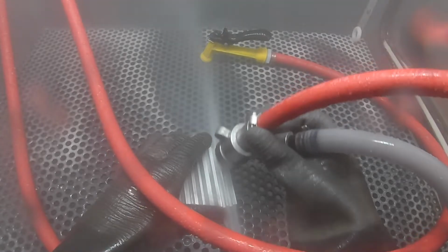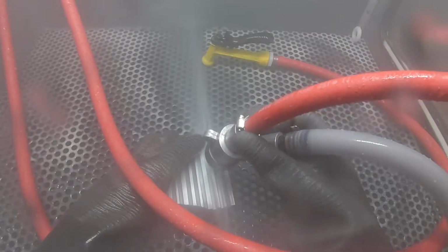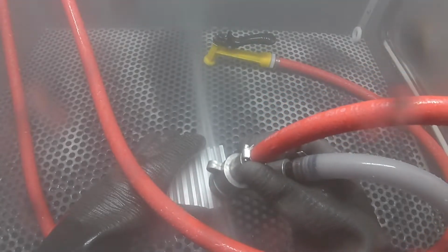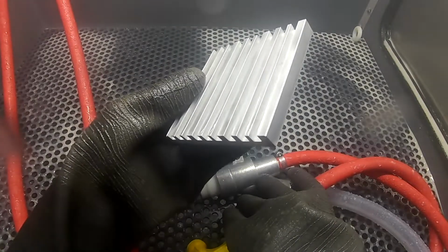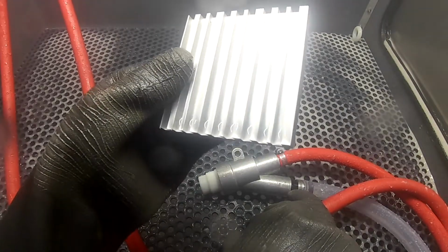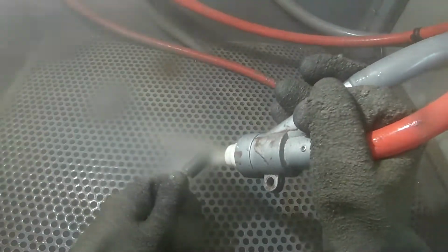based off of the impact of the abrasive. Since we have less impact on the surface than dry glass beading, this also means that we have less abrasive embedment into the substrate itself. In the PVD coating industry, it's a very thin film coating. Obviously, they are very, very stringent and tight on abrasive embedment.